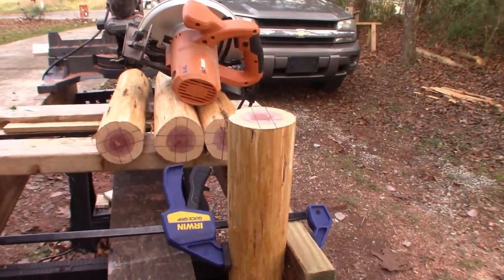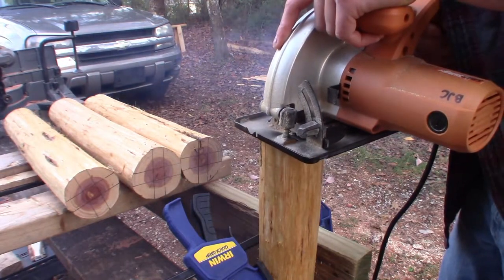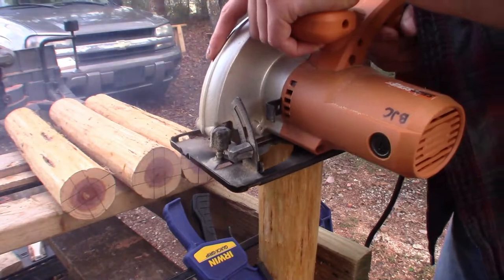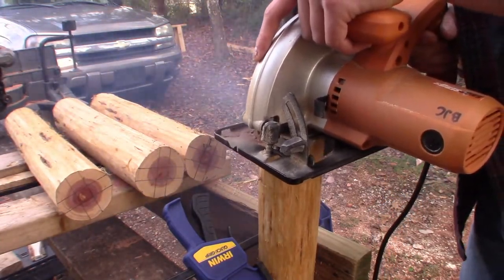Next, we're going to be making castle joints out of the posts. So basically, you just draw a plus on there. That's the thickness of the material that you're going to be using, which in our case is 1x3s. So 3/4 inch is the width of the cross.